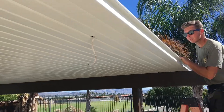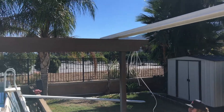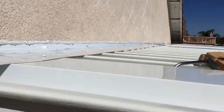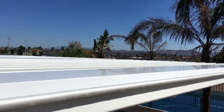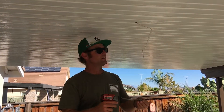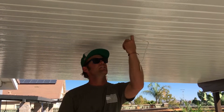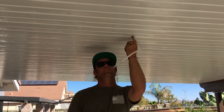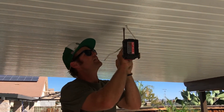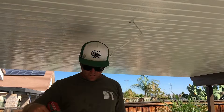There's the wire coming out. It runs over to the header beam and it's all capped. Fan beam's in here, wire's in here. You could have done it at the beginning, but I like to attach this to the beam so it's tight. Put in a self-tapping screw. There, now it's attached.